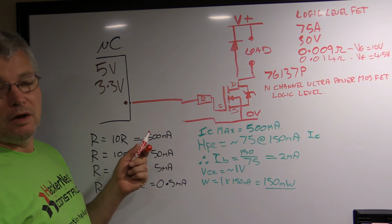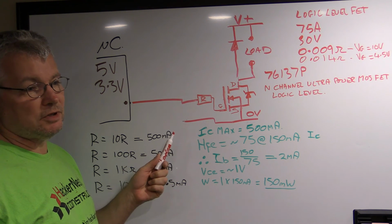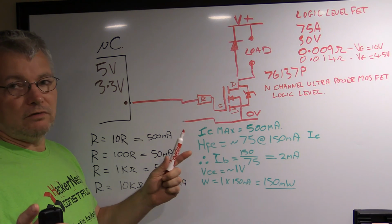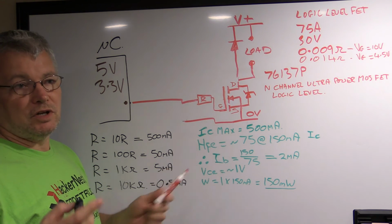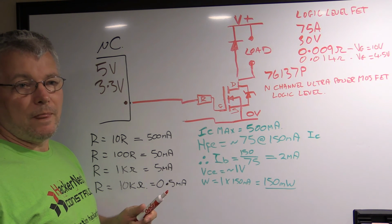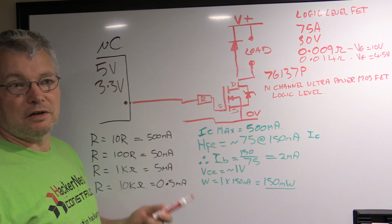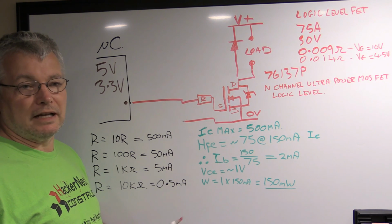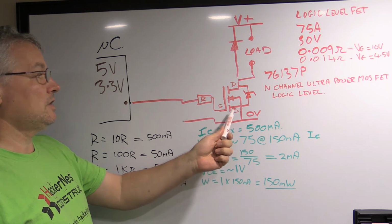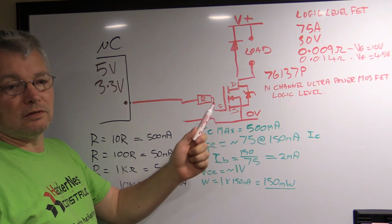I just wanted to show you very quickly, because part of one of the projects I'm doing, which is for the electronic referee for element14 with Texas Instruments, is I need to turn on and off some industrial sensors that would go across the tennis court, and they run at 24 volts, so I couldn't obviously drive that directly. And because there are quite a long set of wires between the microcontroller and the sensors, there's a higher probability of getting magnetic interference from other power systems nearby, from just general interference, radios, cell phones, whatever. Anything that can be generating a magnetic field would get picked up in the wires, and I didn't want it to be backfeeding into the microcontroller. So I had to figure out how to do this. Now, I initially was thinking of using something like this. I actually ended up using a P-channel FET with a slightly different circuit, because I was also opto-isolating the output. So I'll do a separate video for that and how you do that.